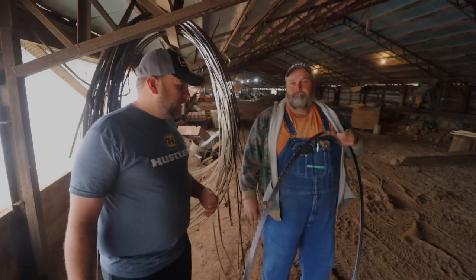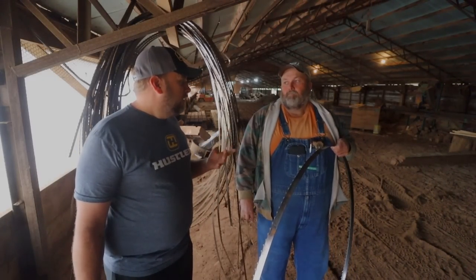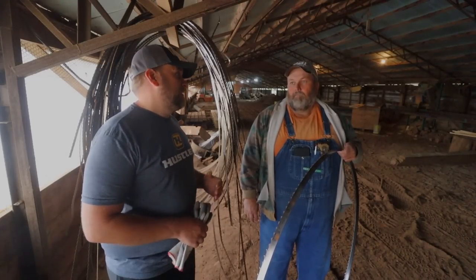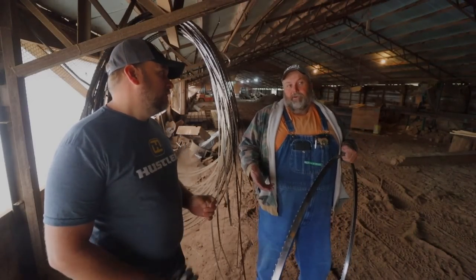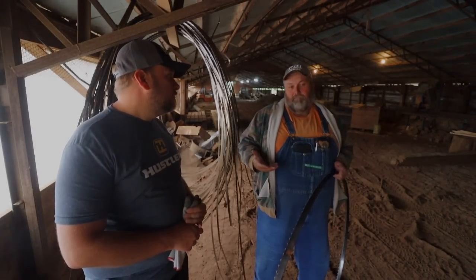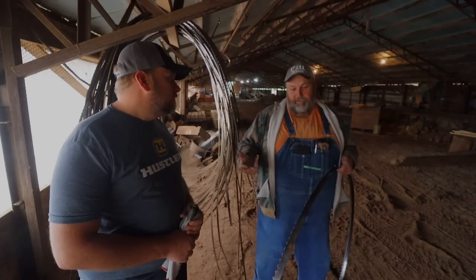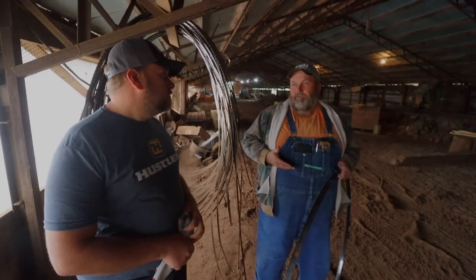Now, I was commenting that I cut 4 logs and had 2 hours on the sawmill before I decided this might be getting dull. Is that standard? Kind of normal, or you know, it depends on what you cut. We can cut all day on one blade if it's fine and not dirty, and you can judge how you're getting along with your blade like this. We work 6-hour days and he would change it at noon.